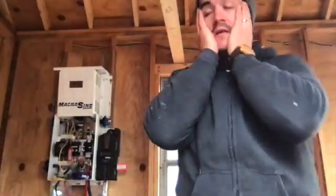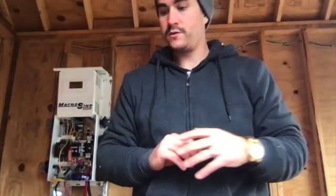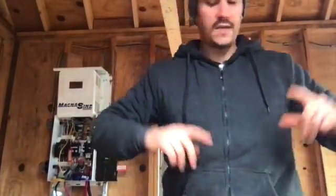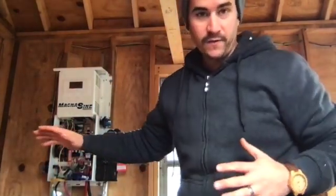We're here, I can't believe it. All right, so what I need to do is go back through all my steps, and then I have to check for PV polarity, which basically means if I got my positive and negative on the DC side switched anywhere, then we're gonna have a fire on our hands. So I gotta take my multimeter and test to make sure I have positive readings, not negative readings. That means something switched. So I'm gonna check for PV polarity, double check all my terminals, tighten them down a second time, and then we're gonna be ready to fire this thing up.